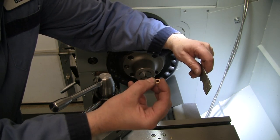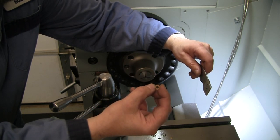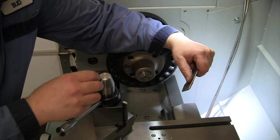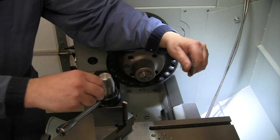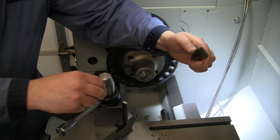So we're gonna knock out those three titanium spacers. They're just gonna be drilled 1/8 in the middle, turned 1/4 inch on the outside. We'll do all that here in the collet chuck, so we should be able to knock that out pretty quickly. And then we'll go lap that bushing down to size, and that's probably gonna be it for this video. And then the next one, we'll be finishing those cover plates and assembling the whole knife. But we'll be able to test fit this and just see how it's going together and how it looks before the end of this one.